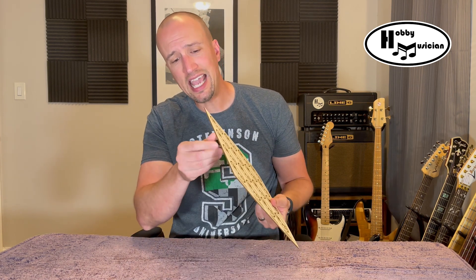The biggest tip I have for you is that it's very, very material-dependent. This was about eighth-inch balsa wood — the flimsiest stuff you can possibly get. I discovered that with my laser module and the speeds I was running, if you go really fast you'll need multiple passes because the laser just doesn't have enough time to burn through the thickness. If you get a thicker material, you'll have to change your settings — more passes, or the other option I experimented with: slowing down the laser. If you slow down the machine but leave the laser at the same power, you achieve the same effect because it has more time to do the cutting.